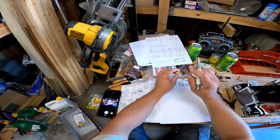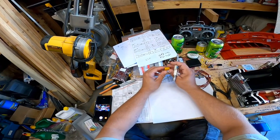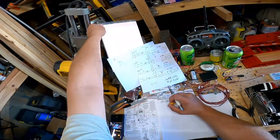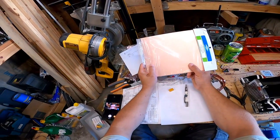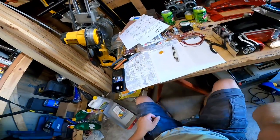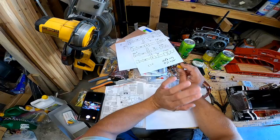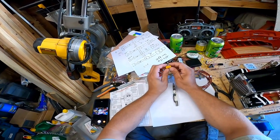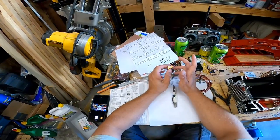So the easiest way for me, this is a complicated circuit because of the number of things on it, but it's a simple circuit. The complicated part is going to be determining how to get from A to B without crossing paths. So I do have a circuit board here that is big. I'm going to have to end up obviously cutting it down, and it has copper on both sides. So if I need to, I can always jump to the other side to cross a line. And because it's not going to have the soldered through connections, I'm going to try and either solder these flat on the top and only go through when I need to pass through with a jumper or something. But like I said, first I got to draw it to make sure I can get it where I want it, and that it'll fit in the footprint that it needs to fit into. So that's that. Let's start drawing, huh?